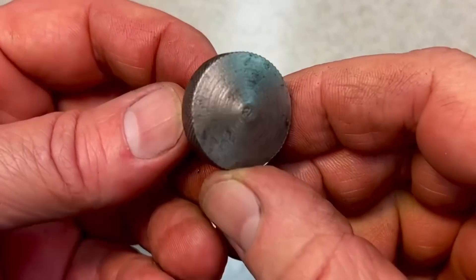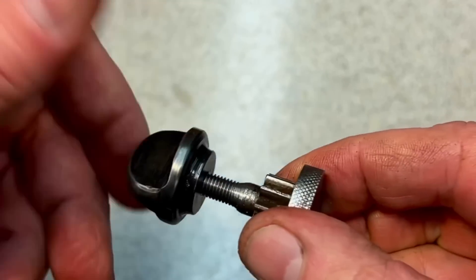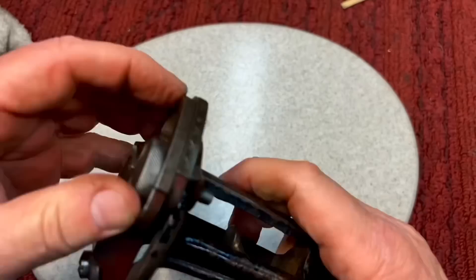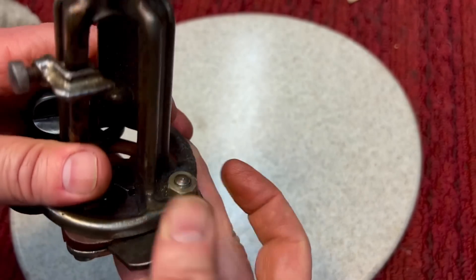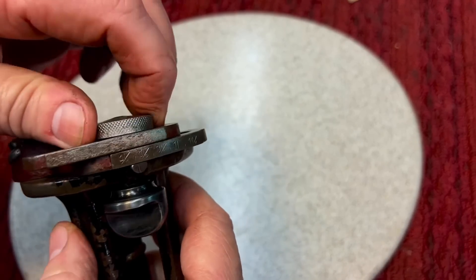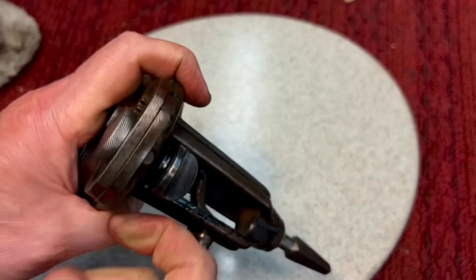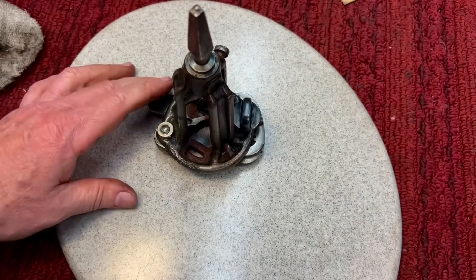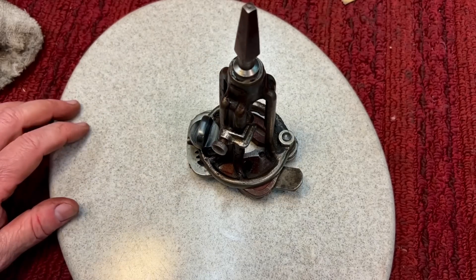We're calling this project done. That's a quarter by 28 thread — very strong — and you can see how it engages into the nut. I blued it just so it wouldn't look out of place. Let's put this on. There we go — a very functional fix. You tighten this down solid so it won't spread open. When you loosen it up, you can see how this will turn one way or the other to set the size you want, then lock it down and it really engages. It doesn't stand out much; you wouldn't notice right away that it wasn't original. Mike, I think you'll enjoy it — I truly think it's stronger than before, because this is machined instead of cast.